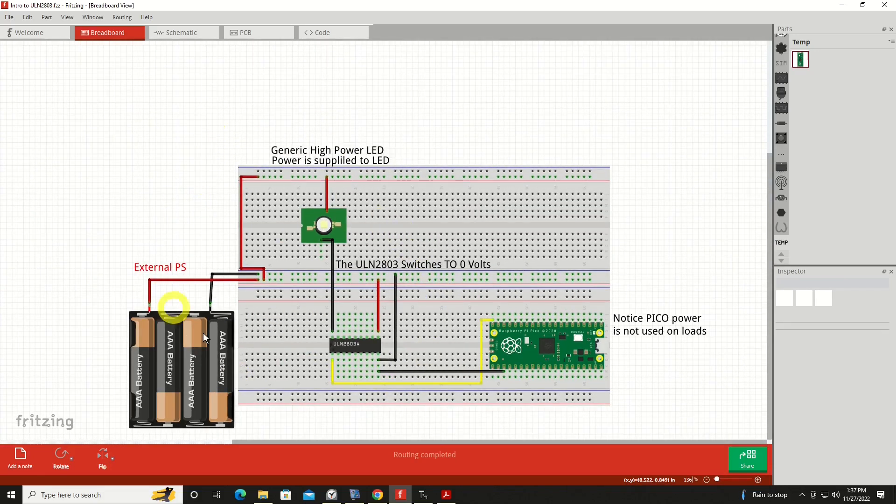So that's the whole thing in a nutshell. The hardest thing most people have with understanding the ULN2803 is that we are providing a path for current to go to ground — we are not powering something. We're always switching what is commonly called the low side of the circuit, meaning zero volts. We're not switching the high side, meaning a positive voltage.